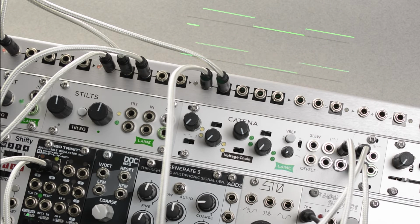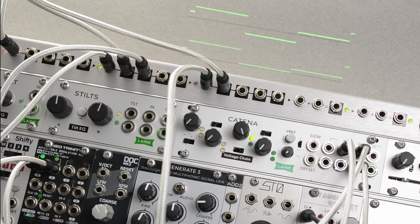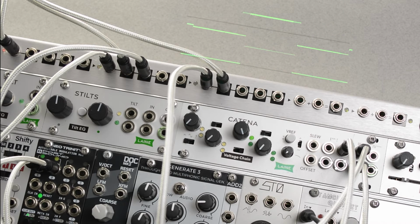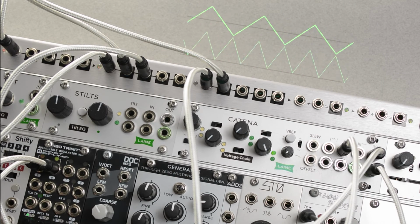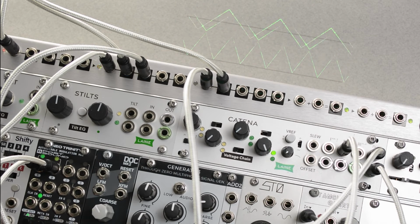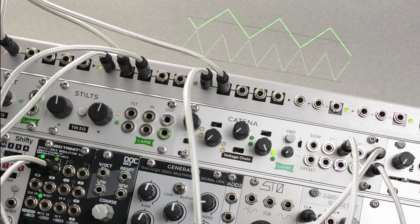When in rectification mode, channel 3 provides some extra gain of around 1/3 of the input, which allows greater headroom when adjusting the rectifying cutoff point. Channel 4 in alt mode switches to full wave rectification, where the full input signal above and below 0 volts is shifted to positive values.